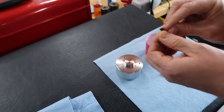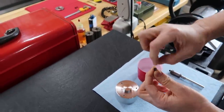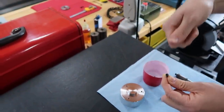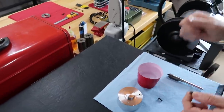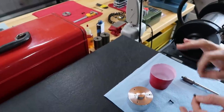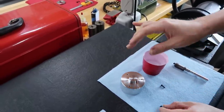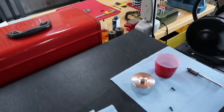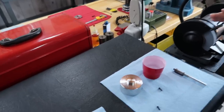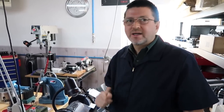Obviously you don't want to go too deep, because then you're going to lose the space in your socket head, and you won't have any room left for the Allen wrench. Believe me, that's from experience. And remember, we're only doing a really light surface cut for cosmetic purposes, so we aren't going to be removing that much material, or we don't intend to. If you're doing this operation for cosmetic purposes, you definitely want to bring the heads down, because you don't want to cut them.